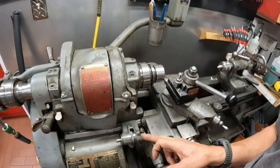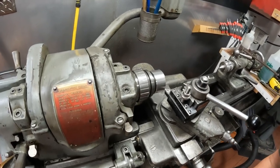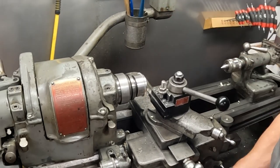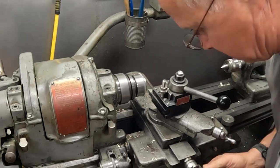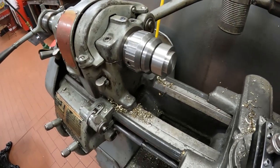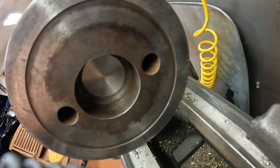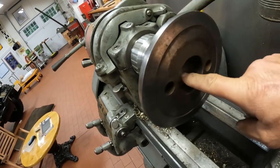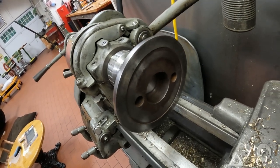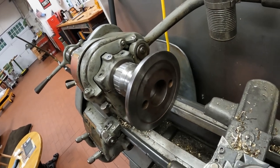This lathe has a mechanical stop which is accurate to about a tenth of a thousandths of an inch. I'll measure the piece and go in 250 thousandths to get it exactly right. You've got to be careful using the automatic feed because it'll jam in there — so stay awake and be on it all the time. That worked out pretty well — 1.560 or thereabouts and a quarter inch for this little lip. You can see it fits right on there, flat in there, just the way it's supposed to be.